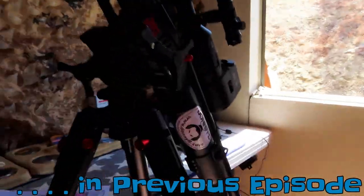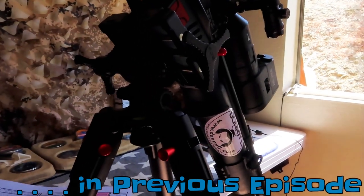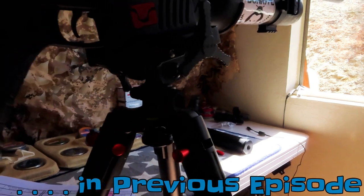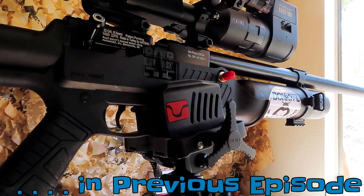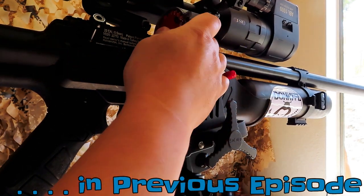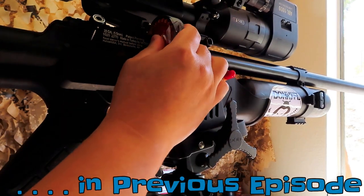Most likely allow the seal to break, empty the air chamber. Then we can replace the seal. We can replace the seal after. Now let's go ahead and test this. So back to 250 bar.